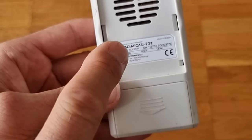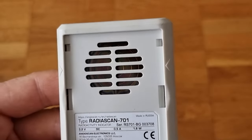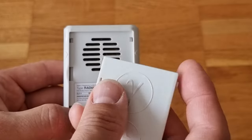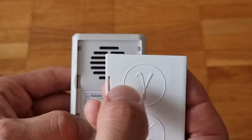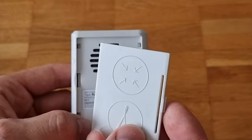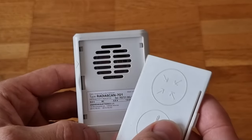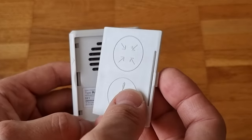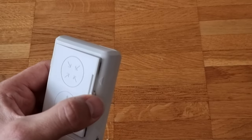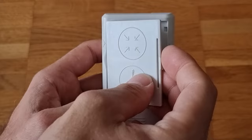The pancake detector here is a very nice Russian-made tube. On the back of this door, you have one section that's got lead, and that is for screening alpha and beta so that you just see the gamma when you're looking for gamma. You'll see the inverse square falloff of radiation, which is why dilution is the solution to pollution — or distance is. I remember someone asking Parkamov, 'Aren't you worried about working near your reactors that produce strange radiation?' He said, 'No, I have them in another room.' So distance is the key here.